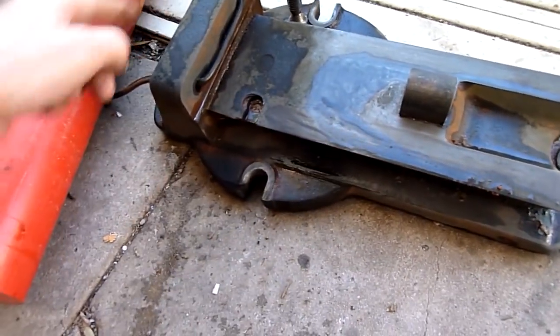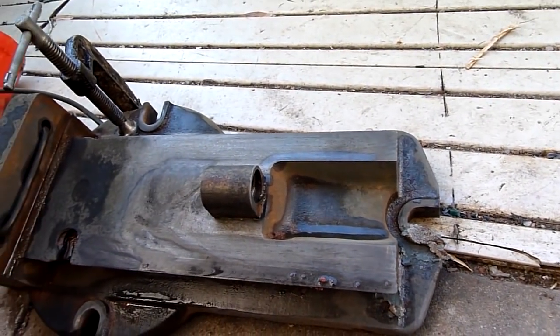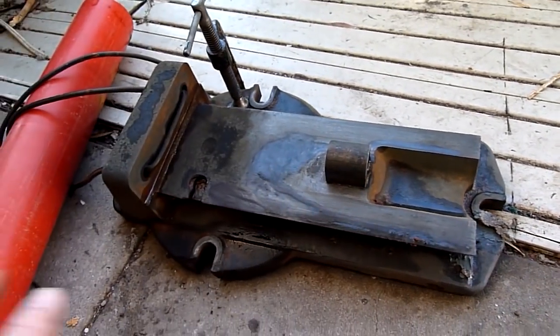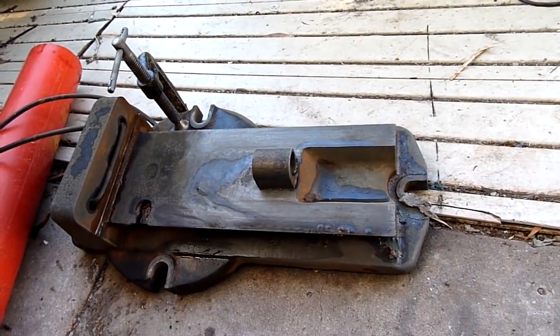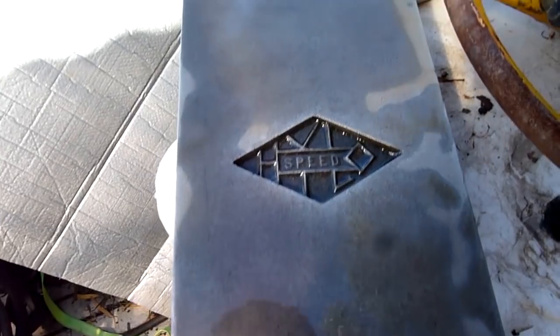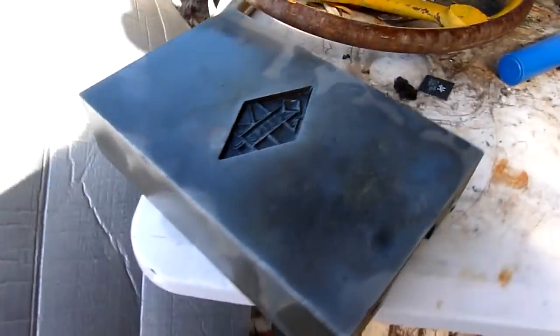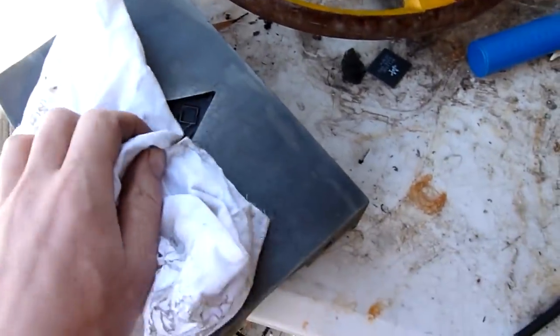I might just paint a bit of the base — really, coolant gets under it and starts lifting it anyway, so I think it'll be a brush job. The top slide I'll just stone, then bake it in the oven to drive off any moisture, and slather it with oil while it's hot. So that's what the top looks like when it's come out after the Scotch-Brite and fresh water. It does oxidize very quickly — that's the only problem with raw iron — but a tiny bit of oxide that builds up is easily rubbed off afterwards.